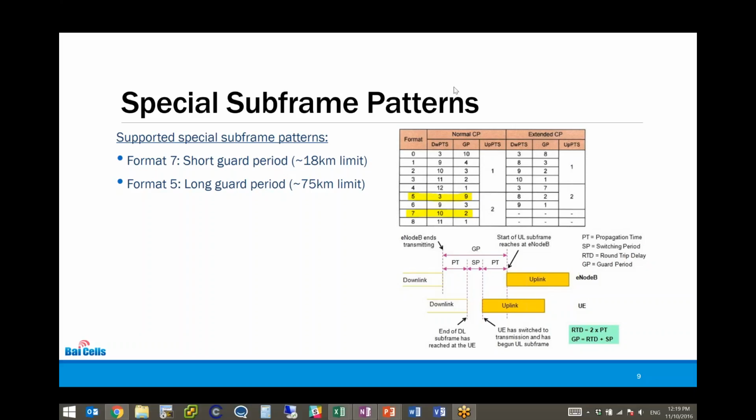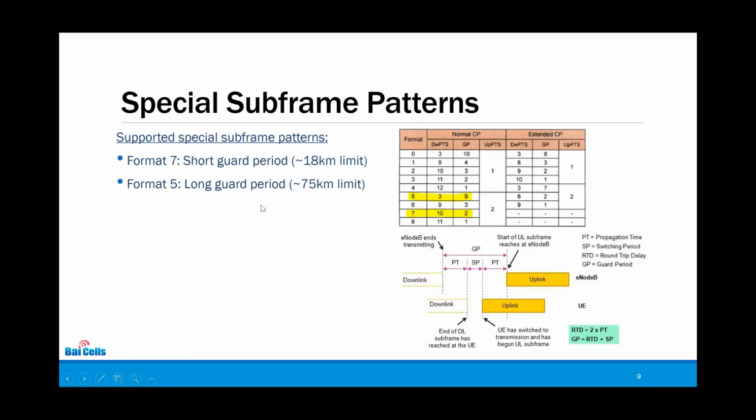Okay, I believe someone asked about the frequency range. I already mentioned in the last slide that the RF filter is actually tuned between 3550 and 3700. But currently, of course, everyone who has the license is only licensed for 3650 to 3700. So even though it says band 43, you could technically select anything in that range if you unlocked it, but the filter only supports a certain range. Tom, no, it won't increase the distance. Like I mentioned, there are a lot of other parameters that affect distance, not just this. This isn't the parameter that's affecting the current distance limitation.